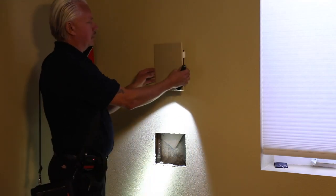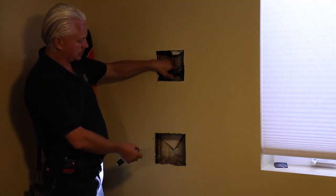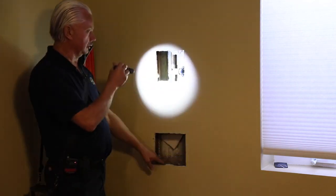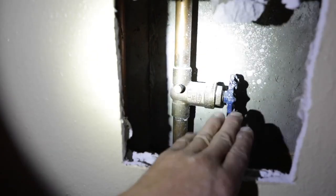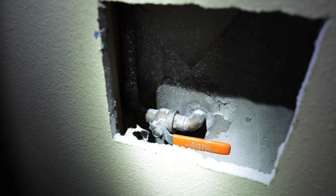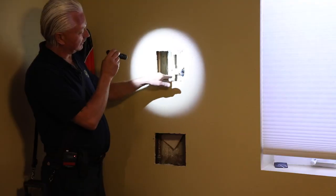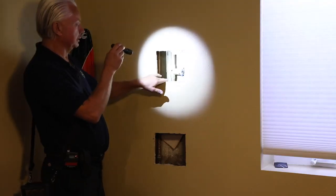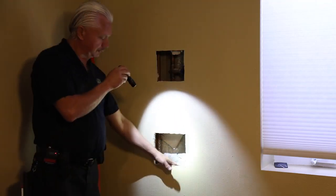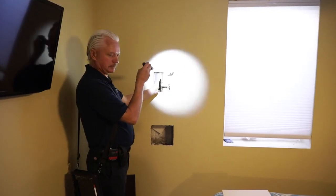You're not required to remove all these, so we wouldn't have known which one was the main, but if they're right next to each other, I'll typically look at both. This is actually the shutoff valve for the sprinkler system. The main water shutoff is a ball valve; on this house, the sprinkler system is a gate valve. Gate valves are still legal and still okay, but most builders prefer a ball valve — they have less chance to leak. You will still see gate valves on your inspections.